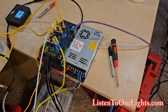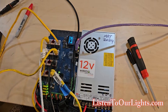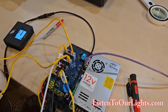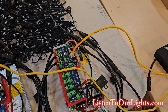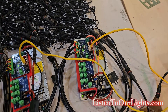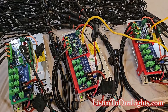Let's run through the hardware setup. We're running off of the Falcon F48v4. This time, instead of having as long a chain as possible, I'm having the shortest chains possible. So this SRX1 receiver board is off of ports 1 through 4 — only 1 through 4, no A's, no B's, nothing. And this one is connected on 5 through 8. This is called traditional mode.